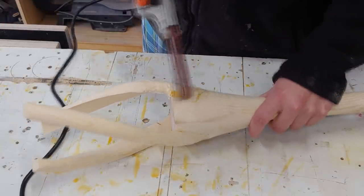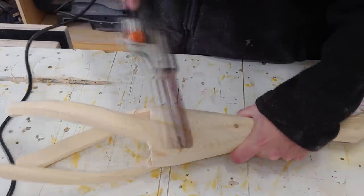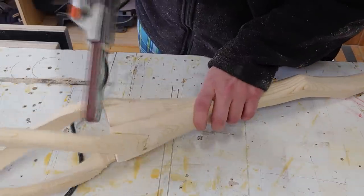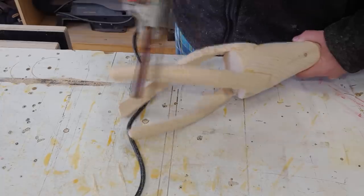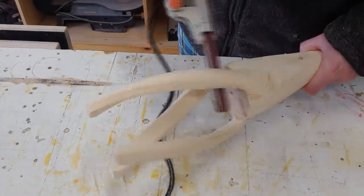With my power file I have installed an 80-grit belt, which is pretty aggressive and took away material pretty quick. This did take the longest time out of the whole project and it was kind of nerve-wracking as I always thought I was eating away too much in the corners. But all in all I think it turned out really good, and carving these inside pieces out was really handy using this — I couldn't imagine doing that all by hand.